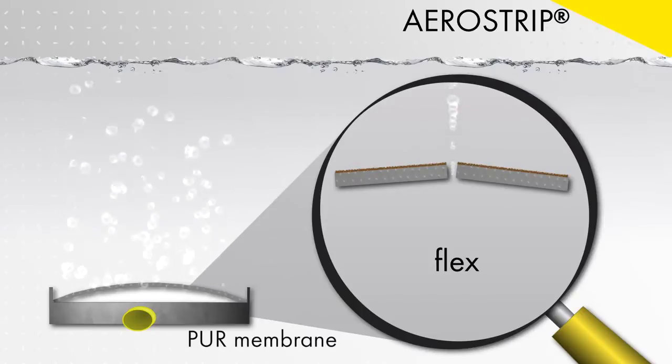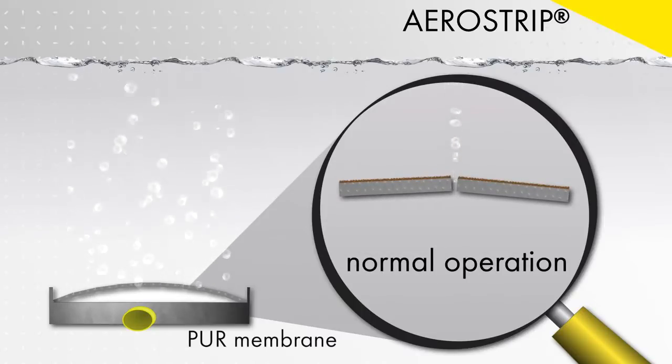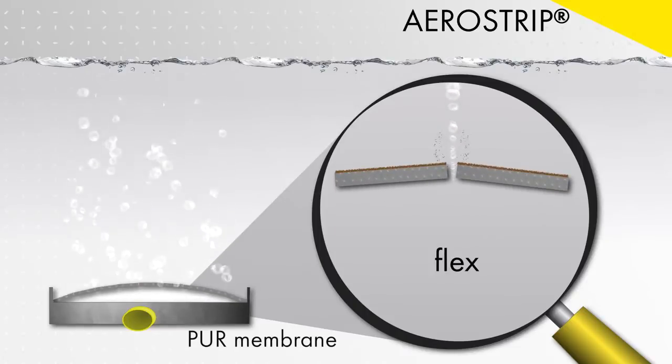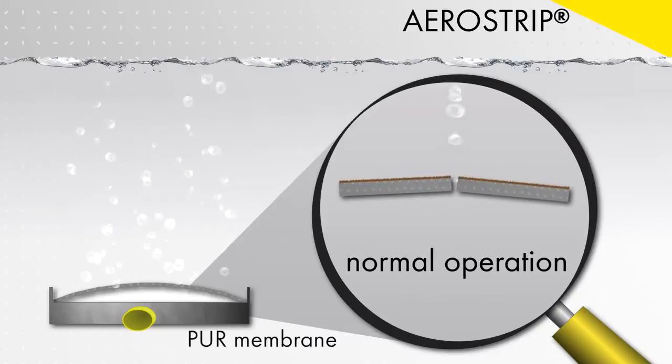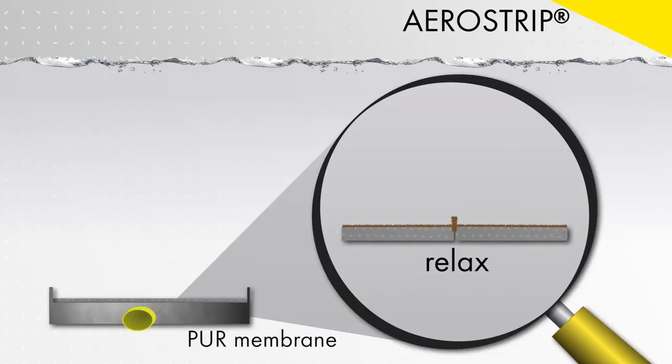During this RELAX step, the pores will loosen the biofilm growth in the openings and make the flex cycle much more effective in clearing the biofilm from the pores and preventing this fouling from occurring over time. This RELAX flex cycle is recommended daily and is typically completely automated. The duration of this cycle is generally between three to five minutes in length.